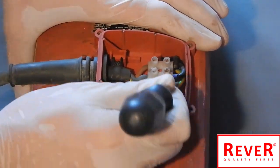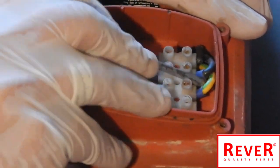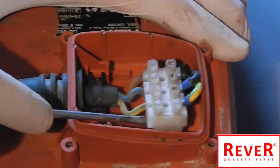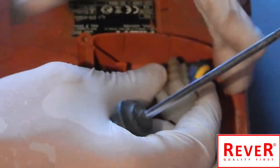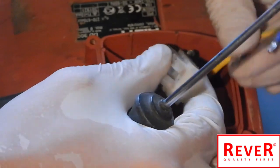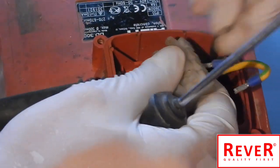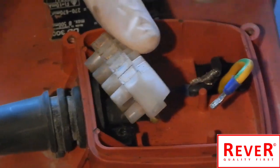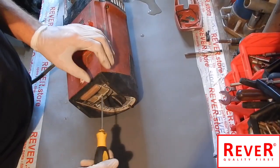Open these three screws of the connecting cable, then push it away and take out the electricity cable. Push it a little bit into the machine inside, because we have to open the cover and we need more space. So we put the cable in.